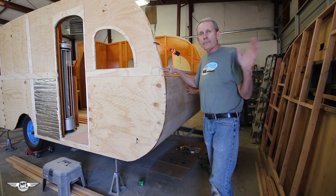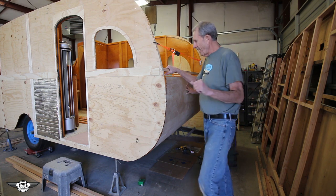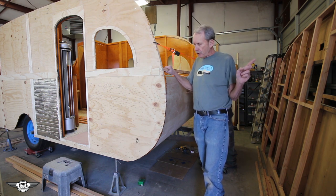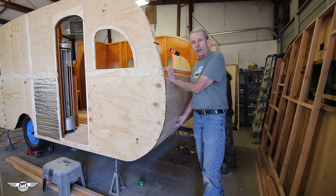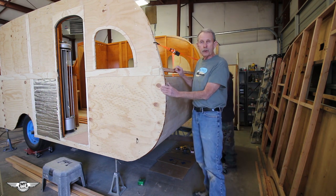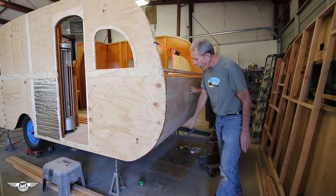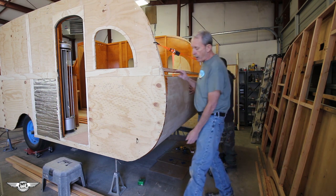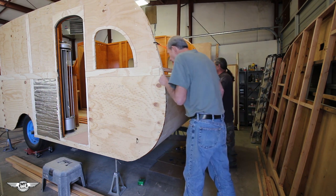I went outside where I stored all the paneling that came off the wrap so I could double-check things. Remember how I'm always telling you people: don't throw anything away or you're done. And it's a good thing I didn't, because this rafter doesn't go here — it goes down here. I've gone out twice now and double-checked my measurements. Rather than put the window part in first, we've decided to go ahead and get the panel started on this end, because we are limited by where the tongue stops it. I have to get it square with the walls, and got the whole bottom screwed in now on the bottom floor joist where the wrap starts.